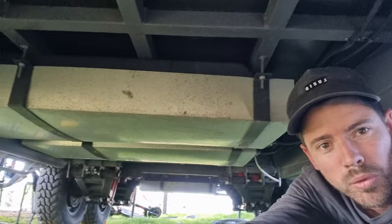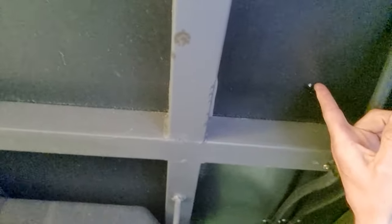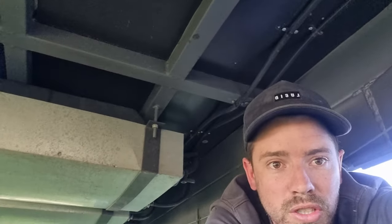It's not the easiest place to film under here but it's a bit tricky too. There's those two big water tanks I was talking about — that's why I couldn't go in that front corner. My little test hole right there — perfect, mate. It's missed everything, missed all the crossbars. You want to make sure you're not going to hit any of the crossbars or water pipes when you're drilling out. Miss all that and you're laughing. Let's drill this big hole out.